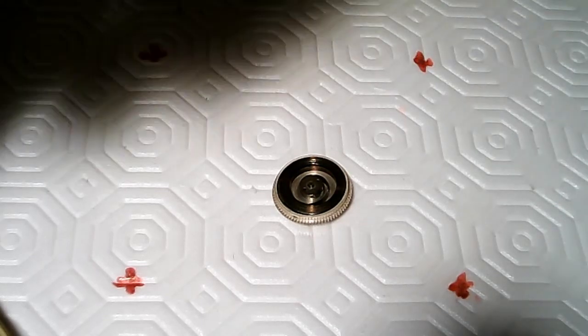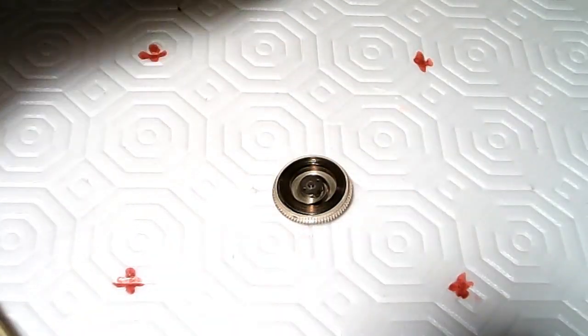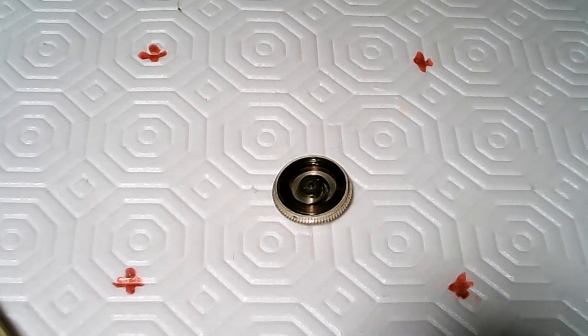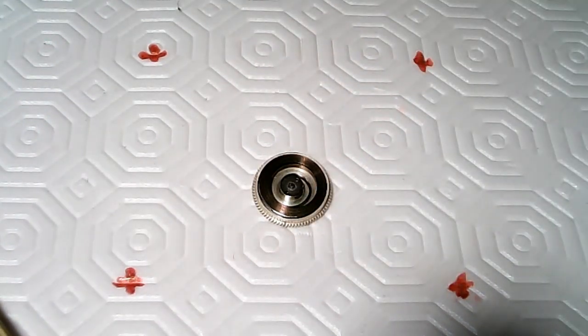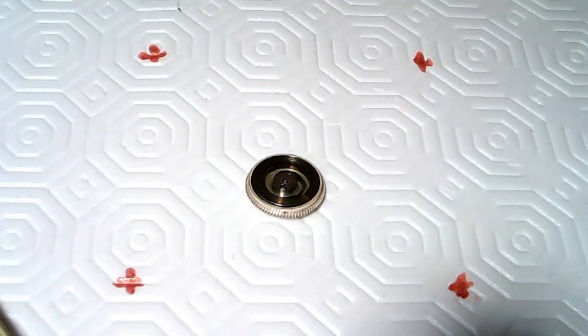And so I'm going to just reassemble this puppy dog. And I'm just putting my screwdriver back right now. I know that's exciting for you, but this could do the job, as opposed to the adventure of taking out the mainspring and everything else, because everything else looks fine. I know when I wind it, it actually works fairly well, and then it slips at the end of about 10 winds, I think. So that's pretty good there.